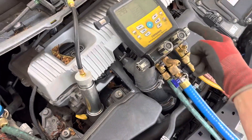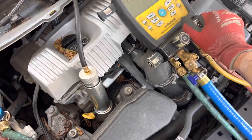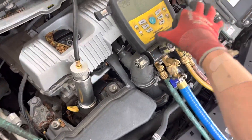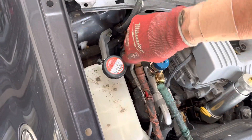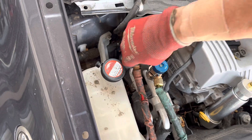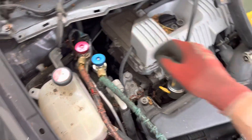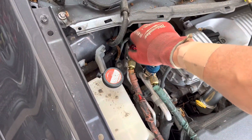What I'm going to do is push a little bit of nitrogen — I have this cracked. You may have heard that little hiss. The little bit of nitrogen I trapped in here at about 100 PSI just purged through the holes and came out here. Now I can tighten this and I know for sure I have no air in my hose.